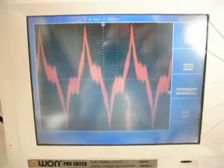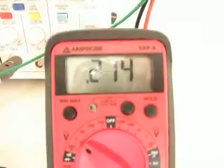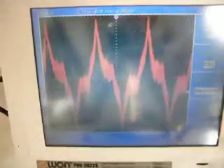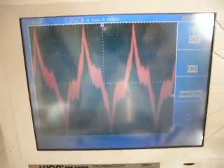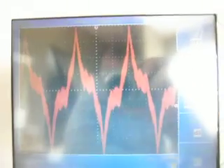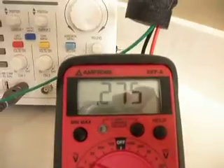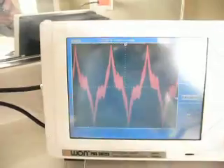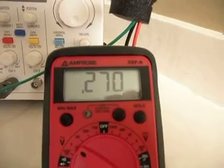There's a discrepancy between the meter and the oscilloscope, and that is due to the distortion of the waveform. Most meters won't read accurately on a distorted waveform like this. That's why you're using an oscilloscope to actually ascertain the correct value — and the correct value today is 1.6 volts according to the oscilloscope. It's another thing you shouldn't get caught out on: the difference between your digital multimeter and what your oscilloscope reads. It's just the way that the two instruments actually perform their measurements that produces a different reading.